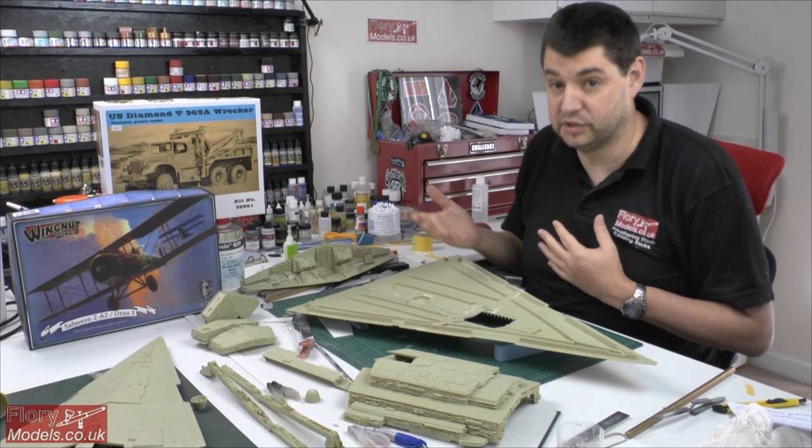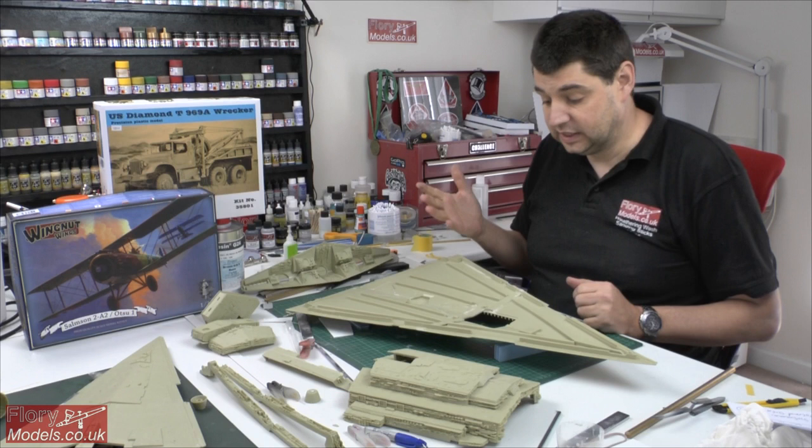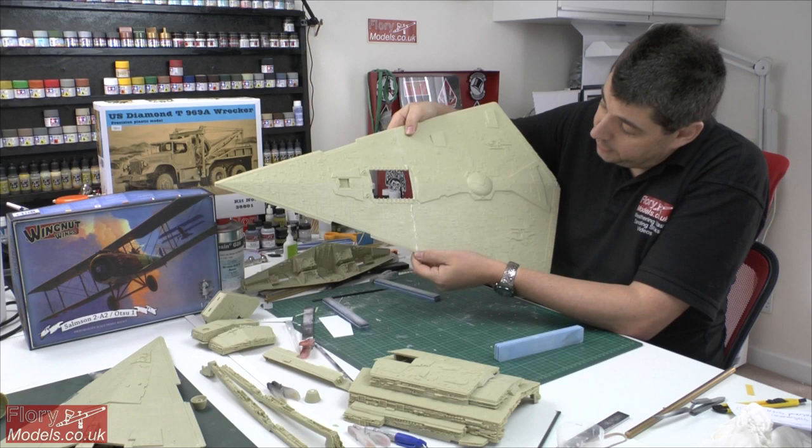But also what I do with it, when I'm working with solid resin, I tend to weld up with it using resin because I just find it's a nice strong flow and you've got a certain amount of control with it, but certainly from working with it once it's set is so much easier. So when you're doing things like down here, this is done, it's raw on this side, this side's been tidied up already, but this lower one, it's really easy because you can cut it originally, then you can sand it, and then you can easily rescribe over resin.